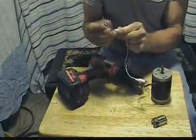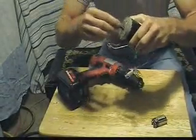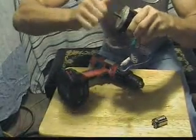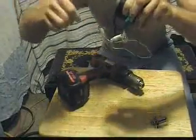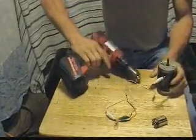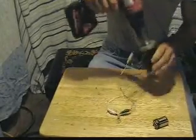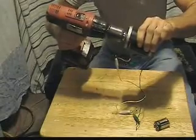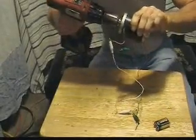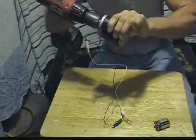Now, my light bulb — you can use variations on this. To show you how powerful this particular motor is, I'm going to spin it by hand, and hopefully you can see the light bulb flash. It's not very bright — it's generating electricity, but that would be very inefficient. So I'm going to take my drill and put it on the end of the motor. I'm going to spin the motor. Look at that little thing light off — see it.